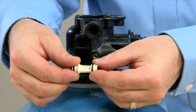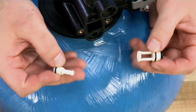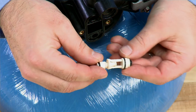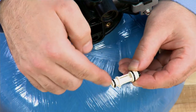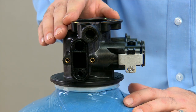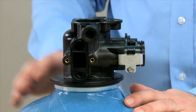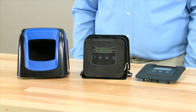These injectors snap together so you can unsnap it in order to gain access to clean the ports on the ends of the unit. When you reassemble, make sure that they do not twist so that you have the spacing correct between the top and bottom half. The body, other than the o-ring and the brine valve, is now clear. Accessories such as meters and bypasses may still be assembled.